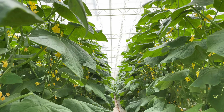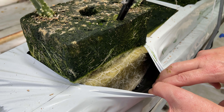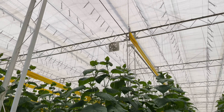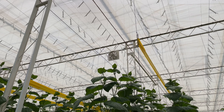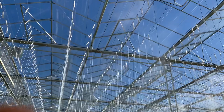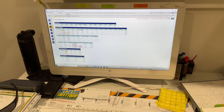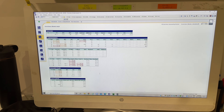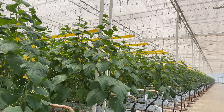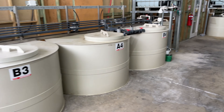The facility uses infrared cameras to monitor leaf temperatures, and slabware to weigh the slabs and measure the amount of drainage from the slabs in real time. These monitoring systems are fed into the environmental controls — like the shades, fans, vents, and foggers — through the computer system to control up to 18 environmental factors. All of this data is collected so that the growers can make the best decisions as to how to feed the plants and what nutrients the plants may need. All of these factors are intrinsically linked; if you change one variable like relative humidity, it will then change the temperature, which will then change the temperature of the nutrient solution, and it cascades.